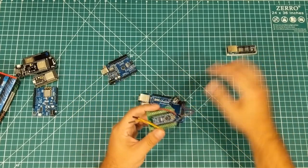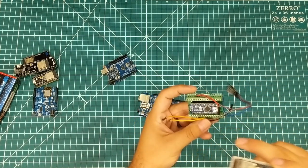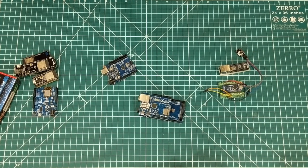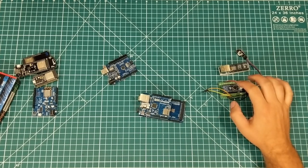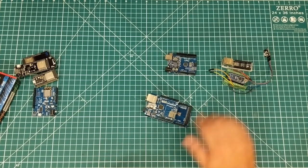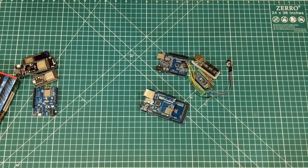On the Nano, it has a really cool Ethernet shield and this thing is a couple of bucks. You could build a setup for about $8 with a screw shield, an Arduino Nano, and an Ethernet shield — but it has so little memory you can't use it for a lot of things you'd actually want to use it for. When I use a Uno or Nano to do Ethernet, basically the only thing I can do is GET requests. I want to be able to use MQTT and build more advanced IoT devices, but there just isn't enough memory or processing power. All of these together don't have the horsepower to negotiate HTTPS requests, which means you can't truly secure your data.